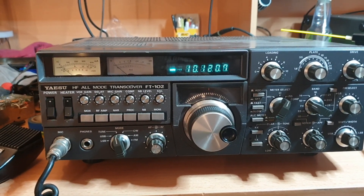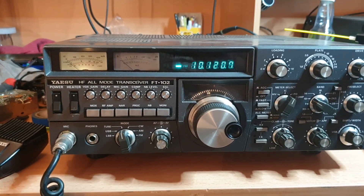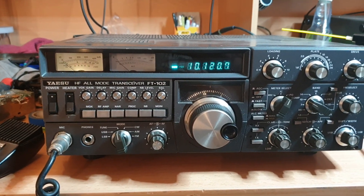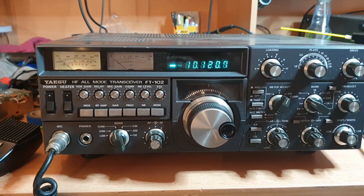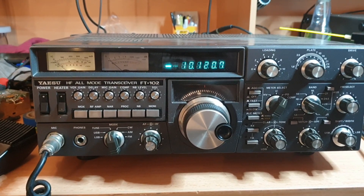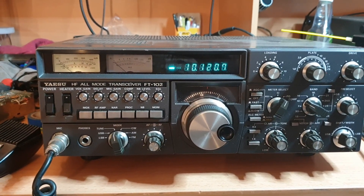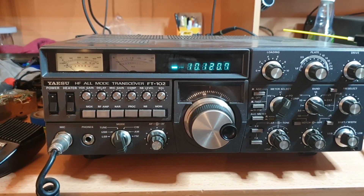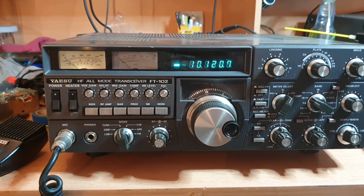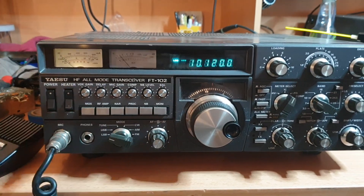I've got probably quite a few radios that I'm just going to move on as-is, and hopefully you guys can learn a little bit about replacing a few bits and pieces — especially the relays. Generally every one of these I've done has been relays, and not much more. Half the time I've replaced a few caps, but when they're up and running they are lovely old radios.